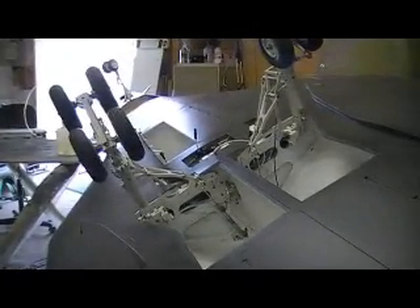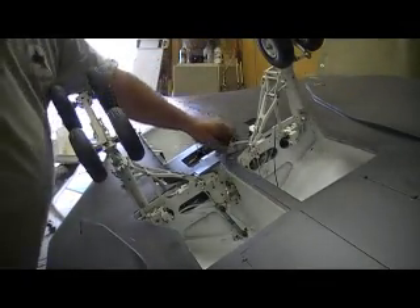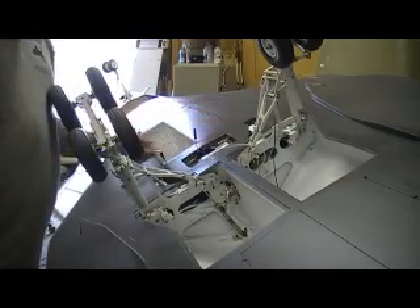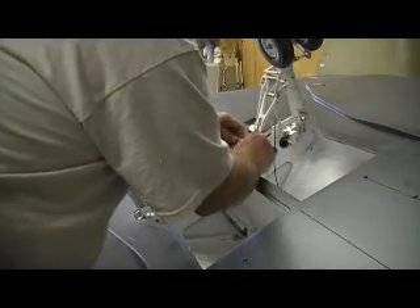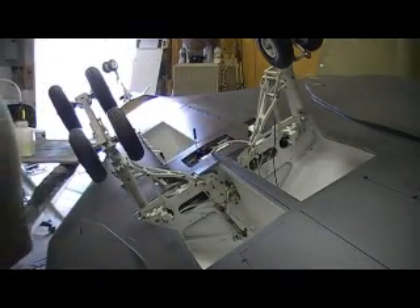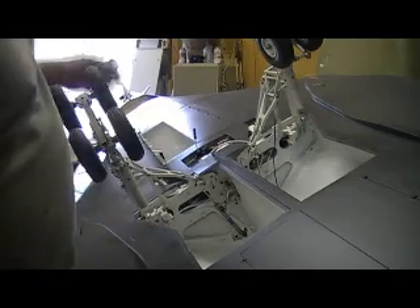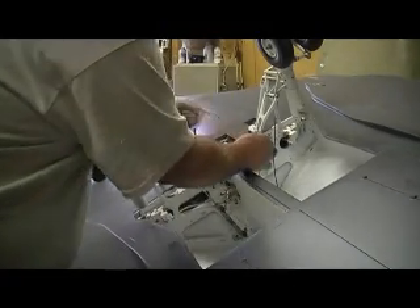What I've got to do is get oil into the whole system — air lines and air cylinders — and I think the best way is one at a time. I took off all my air lines and put in a one-way check valve, so everything's blocked off. I should be able to hook this up to my reservoir with my Wesson jug, turn on the system, and fill it that way. I'm going to do the accumulator last.